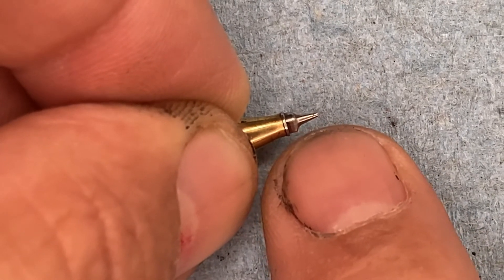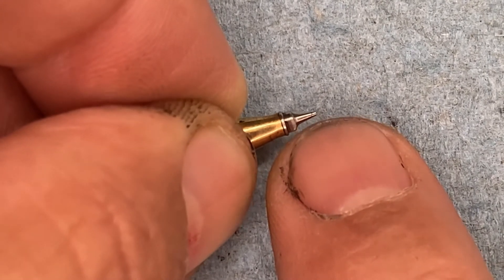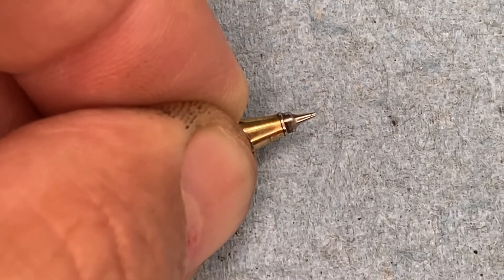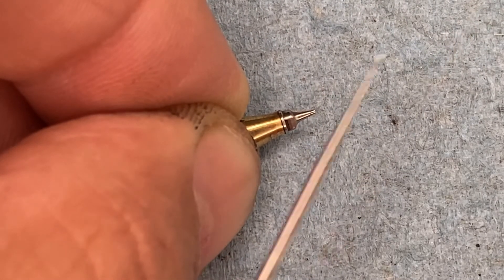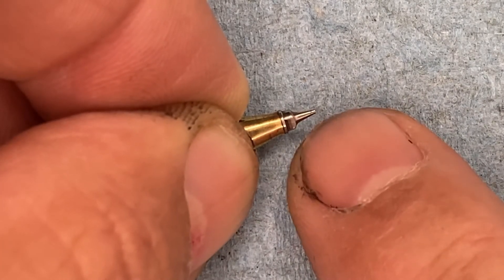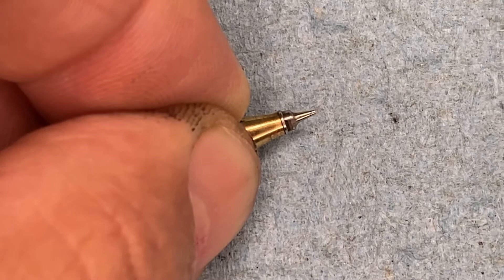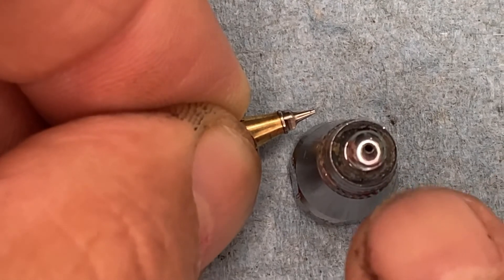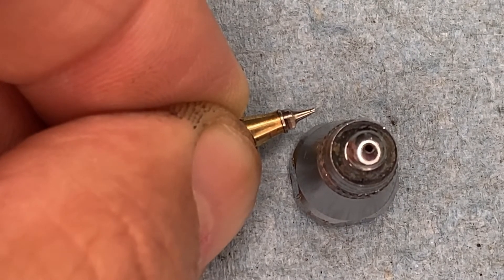If after taking it apart and checking for cleaning and so forth this still occurs — something that occasionally happens — you want to take a good look at this nozzle, which you should be looking at from time to time. You're going to need to look under a magnifying glass. If the needle is constantly being pushed in there hard, it is possible for the nozzle to get flared out on the end. If it starts looking like a trumpet on the end, what will happen is it'll start filling up some of the space in the hole here and start to block off airflow, and performance will degrade significantly — plus it'll start spraying a little bit weird. At that point you would have to replace the nozzle.